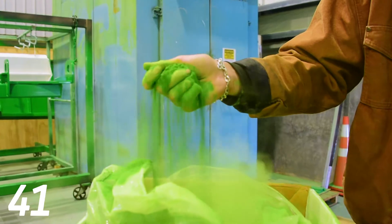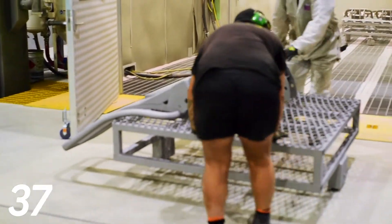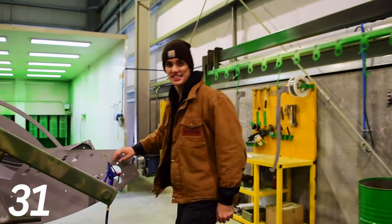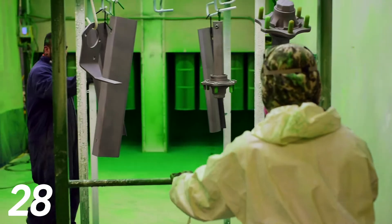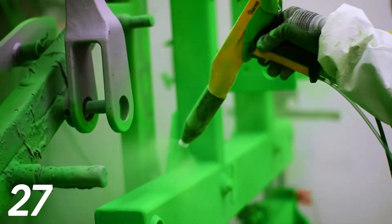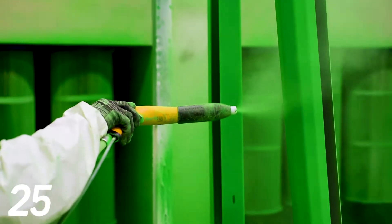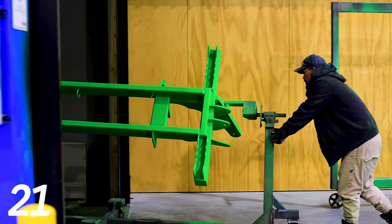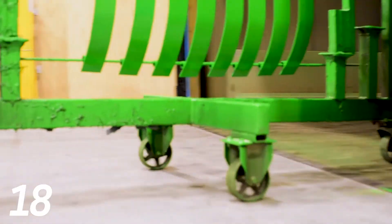And this is the crazy part — powder. And this is how it's done. All of Hustler's machines are wheeled into the sandblasting booth with our sandblaster down to a white metal. Then it's air blasted to get rid of all debris and the key profile is tested. Next step: powder coating. Then it's baked in a state-of-the-art temperature-controlled oven.